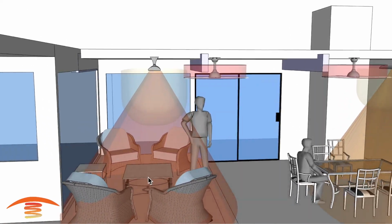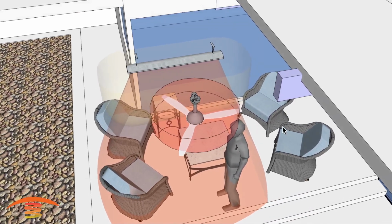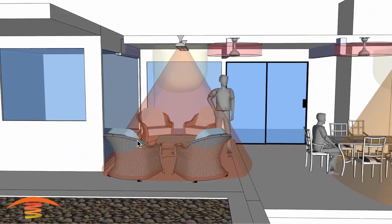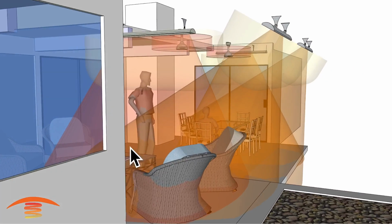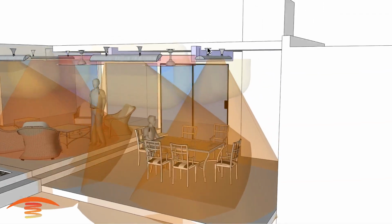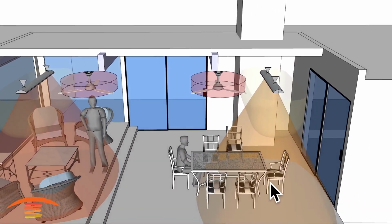And in this case, you can see that the footprint of heat is fairly decent. Over here, obviously, we're not hitting the chairs properly, but it would be a more even flow of heat versus something like what I just showed on the outer edge, where this would be a hot spot and out here would be a cooler spot. It's not as even a footprint of heat, and that's true over here as well. So I like something like this a little bit better because it's just more even as far as its amount of heat throughout the area that it's covering.